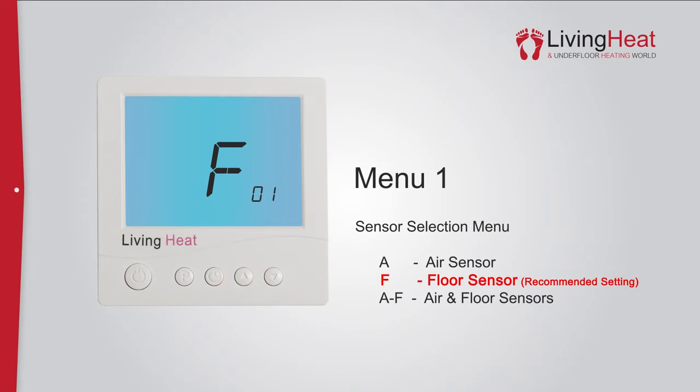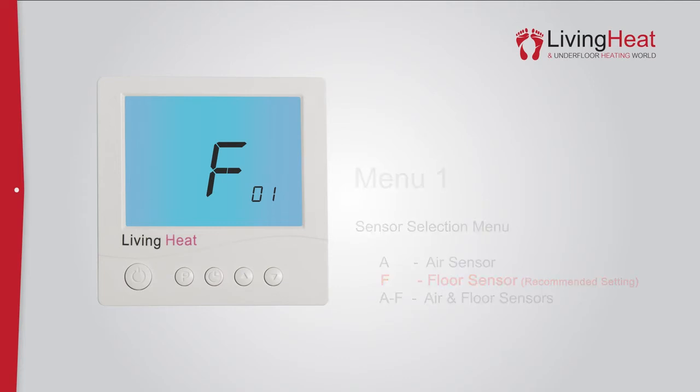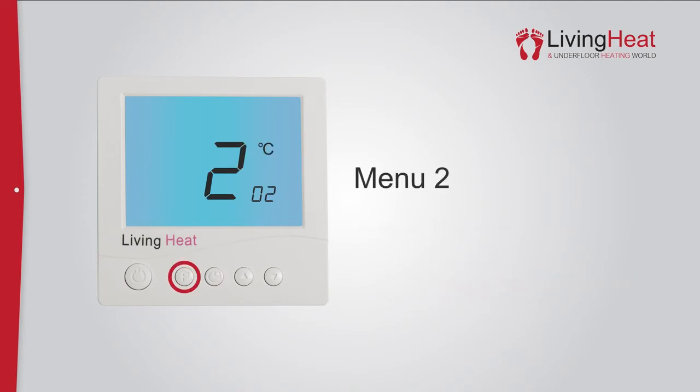If you are heating a wood or carpet type floor covering, we would recommend never using A only, as this limits the thermostat's ability to regulate the floor temperature, which can lead to the floor being overheated and damaged. This is particularly relevant under wood and carpet type floor coverings, as these types of coverings have a max recommended operating temperature, typically set by the manufacturer. When you are happy with your selection, press the P button once to move on to menu 2.